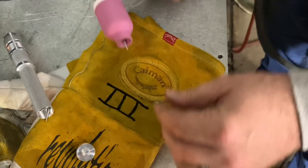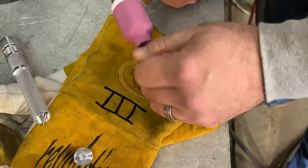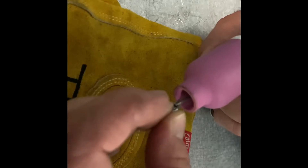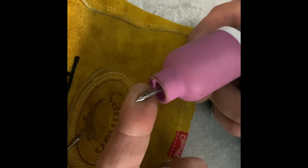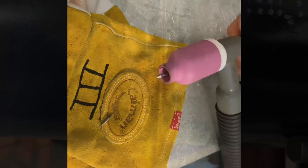Because the angle that the tungsten is ground gives a different effect on the weld profile, some of them give deeper penetration. This one that we're putting in right here gives you deep penetration, so that's what we're using for this root face feeding. We've been using these for about six months now. We're not at liberty to say who makes them or how they're made or what material, but they work really well.